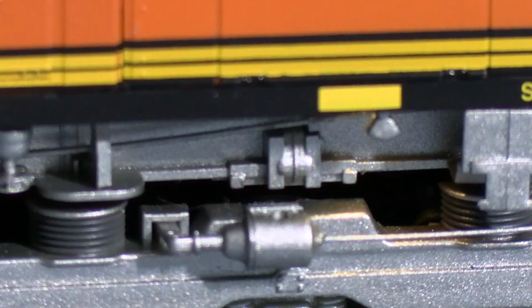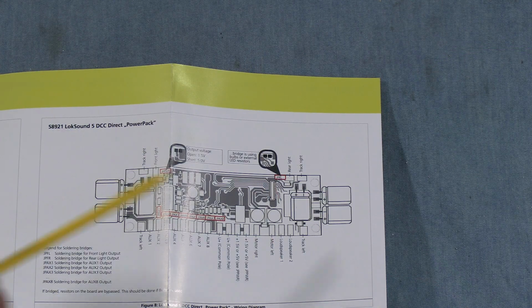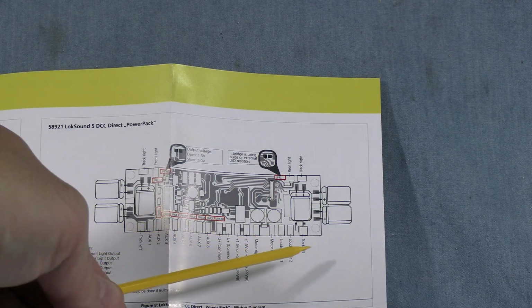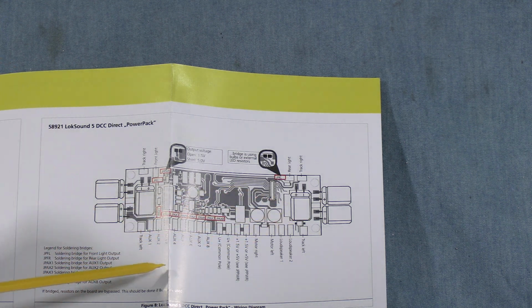The ground lights, on the other hand, should operate together, so I've spliced both leads onto a single tan wire. DCC color coding does not have enough colors to standardize decoders with a ton of lighting outputs, but it's still a good idea to use different colors to keep yourself from mixing things up.